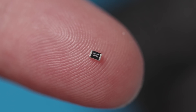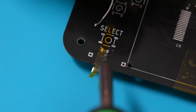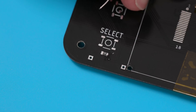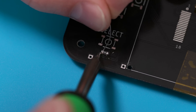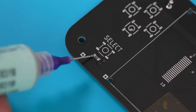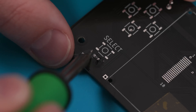Once you've got the shoulder buttons down, we've got to move on to one of the trickier things to solder, which is this tiny 3R90 resistor that goes below the select button. I decided to tape one side down with Kapton tape and soldered it one side at a time. This method worked pretty well for me. However, if you're struggling to get the solder to stick — it's a very, very small spot — this is where flux can come in. Flux has several purposes, but its amalgamative properties attract solder like crazy to the intended joint. Apply flux liberally, then tap your soldering iron with some solder on it right against the joint, and you will create a perfect connection almost by magic.